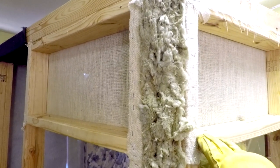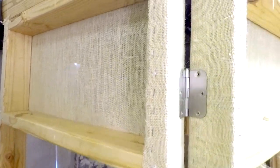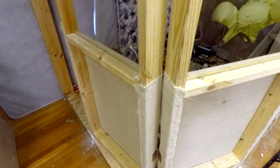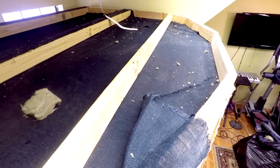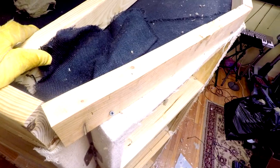You can see where these two wall panels come together — we stuffed insulation in between to fill in any cracks. You can see how we attach these frames together with just simple door hinges. At this point all the insulation has been removed from the roof. We have this burlap material that we're stapling down to the tops of the wall panels, and we built up this two-by-four frame for the roof insulation to sit into, toenailed into the tops of the wall panels. We need to remove these two-bys before we can start disassembling the walls.